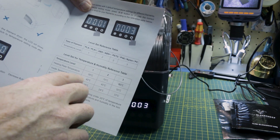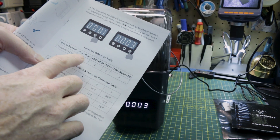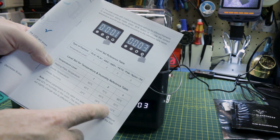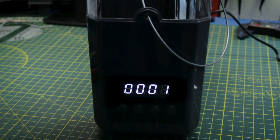Mode one, two, and three just correspond to the temperature levels 55, 70, and 80 degrees, of which one is the lowest. PLA, PLA+, ABS, PETG, and Nylon — so we want it on setting one and just let it go. The default drying time is 18 hours, so that should be just about right. We'll come back tomorrow and see how we end up.